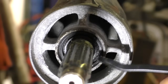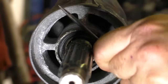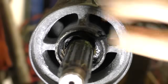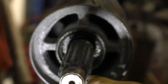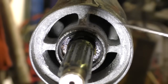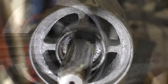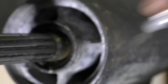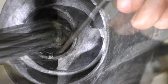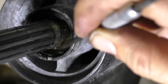But you can also start to see under this is the internal metal casing. You can see it doesn't take a whole lot to start pulling the rubber part of the oil seal out. I will confess at this stage the outer one's easier to get to because it's not as deep in the gearbox, but the oil seals themselves are identical. Now I've pulled more of the rubber away. You can see there's actually a bit of a gap here. This metal bit doesn't reach the prop shaft itself. It's not, otherwise it would scratch it. This part of the metal here is the casing. This slip here is a part of the oil seal, and this back plate's a part of the oil seal.